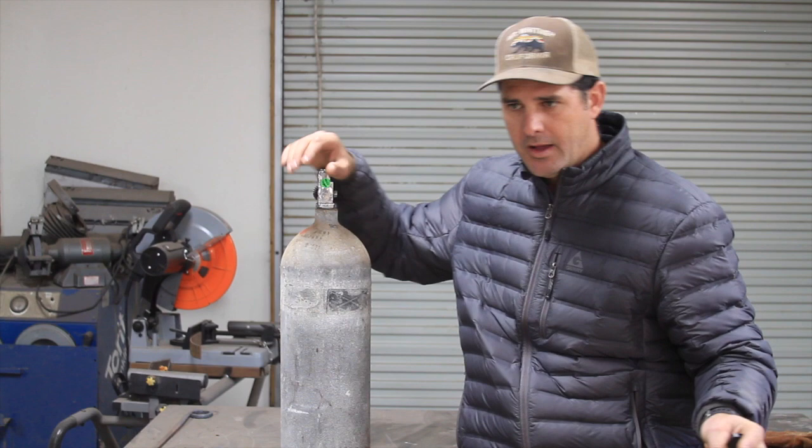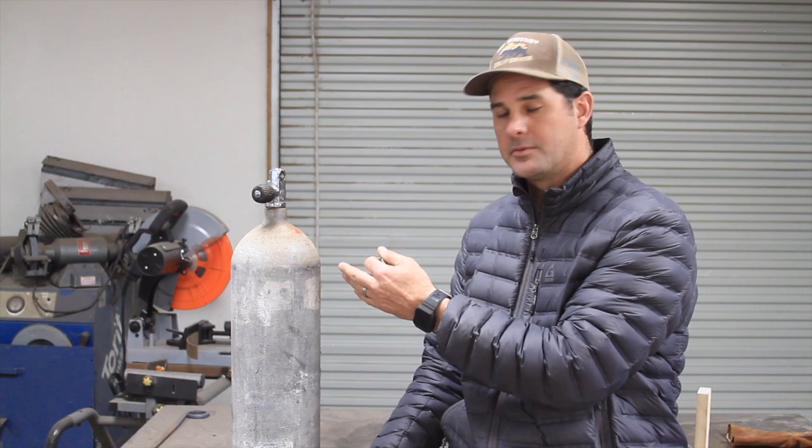The things I wanted to go over were some safety issues. Obviously we're cutting into a tank, and you don't just want to grab any tank willy-nilly and start cutting into it with a torch or a grinder or anything. Before you cut into a tank, know what was in it, know if it's under pressure. In this case, because we're cutting a scuba tank, they are usually under high pressure unless it's already been released. So the first thing you want to do is release the pressure from the tank.